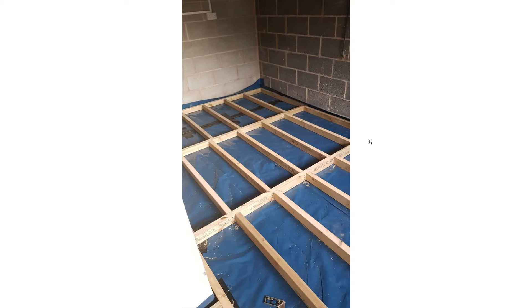There are a number of ways of doing this. I could have put the walls in first directly on the concrete floor, but I chose to put the flooring first and then have the walls come down just off the floor. I chose to build a wooden floor — I think that's personally the better way of doing it. It's better to take the taper out over the width rather than the length; if you try to do it over the length, a long piece of wood won't be very straight. So what I've done is started at a certain height and gone slightly higher on each successive piece to take the taper out over the length of the garage floor.